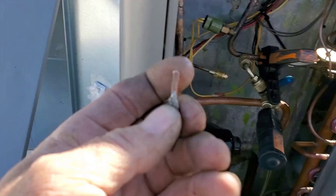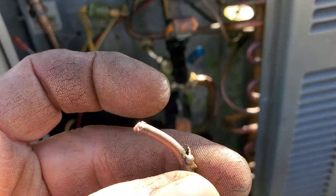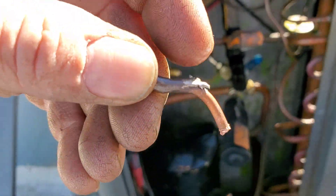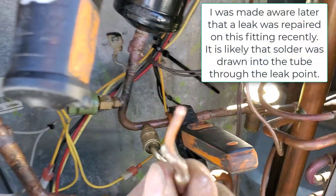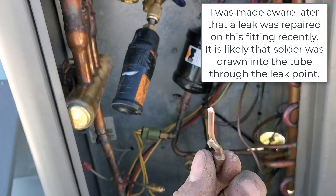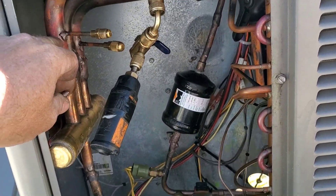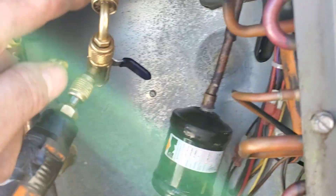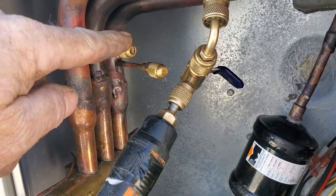I'll bring this souvenir back. You cannot blow through this at all. You can tell it's been welded on just because it's got this drip right here — I'm pretty sure factory didn't send it out like that. So somebody's probably changed that TXV out, or maybe they had it out. Or maybe debris got in there — that might actually make more sense. They recently changed the expansion valve. Evidently doing quite a bit of troubleshooting because there's a port added to the gas line.